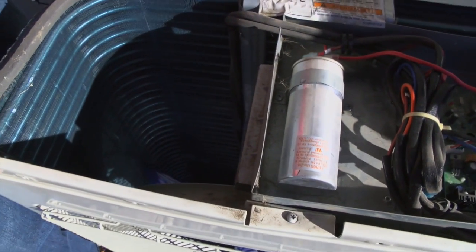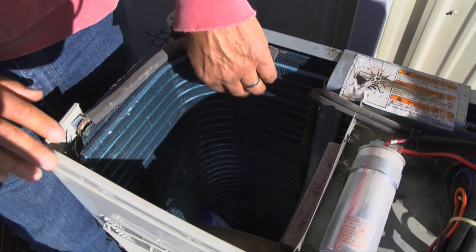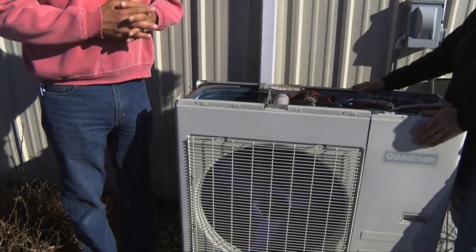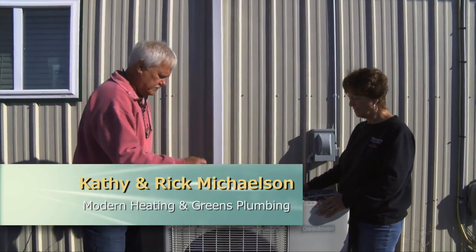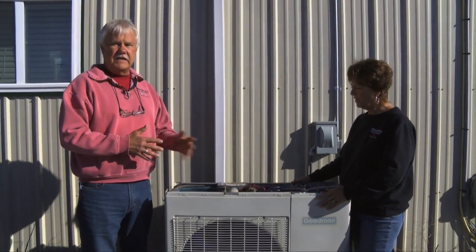The most important thing people need to be aware of: you can see this coil, and these fins are very close together. So when you're mowing your yard, make sure you're throwing the grass away from this outdoor unit. Because if it happens to be running and grass flies up against the unit, it's going to plug up that coil right away. And just regular spring maintenance — because of all the dirt, leaves, and everything that could be blocking things — we'll come in, open up the unit like this with a garden hose, and spray this coil down from the inside out to get not only the grass but the dirt and all the other stuff.